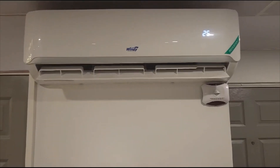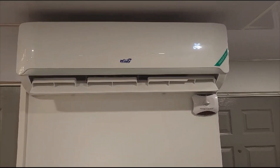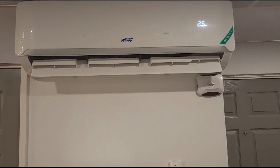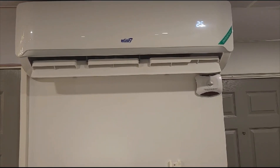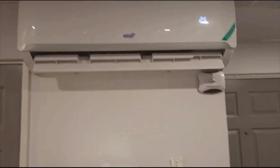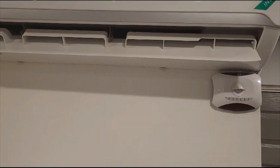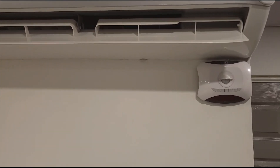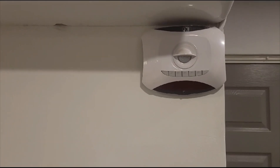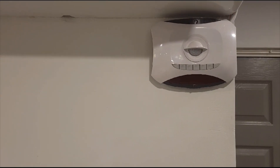So back to the little gadget underneath, which is our ecosystem. One thing about the unit in the living room — if for some reason the balcony door is open or not completely closed, this unit will shut down in five minutes. So you need to keep note of that. The unit will not run if the balcony door is left open. One way that you will know that the balcony door is not completely closed is that a red light will pop up on this unit, as you will see shortly when we go and open the balcony door.